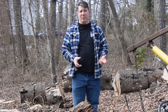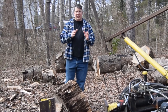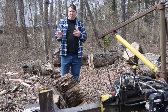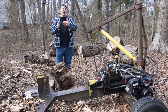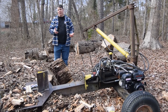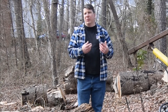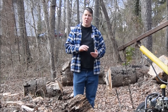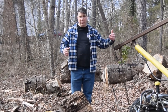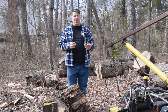In a previous video I explained how a two-stage pump works, commonly used on log splitters — mine included. The two-stage pump has two pumps in it, and either one will work or they both work together. Going up to the log, I want all the flow I can have but I don't need all the pressure. As the cylinder moves towards the workpiece, we want to move as fast as we can to save time. That's what the two-stage pump does — both sides pump together giving large flow, but it's internally limited to a low pressure so it can't do much work, just moving towards the log.